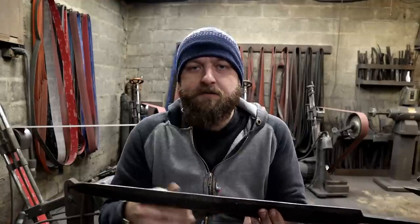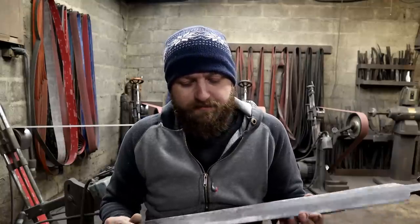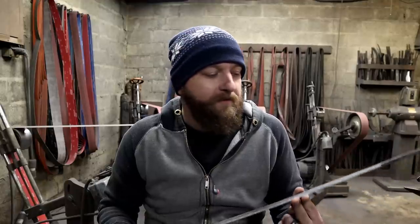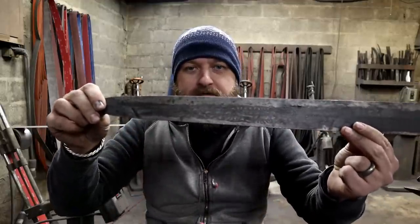So I'm gonna take a page out of my partner Ilya's book, and I'm going to reforge this blade. I'm going to flatten it out, stack it up upon itself, add in some other material, and forge a new short sword that I'm sure I'll be happy with this time. I guess my pattern got a little skewed from side to side while forging the bevels. Anyway, no matter how it happened, it happened. You can see I'm not too thrilled with it, so today, we're gonna restack it, forge weld it, make a new blade.